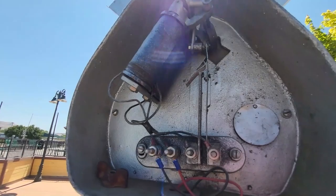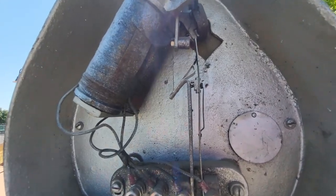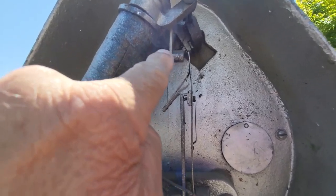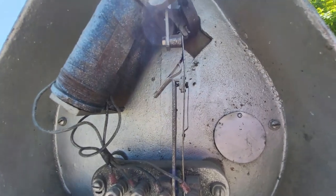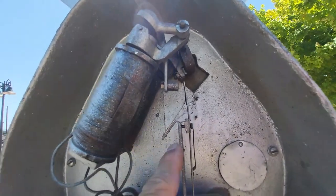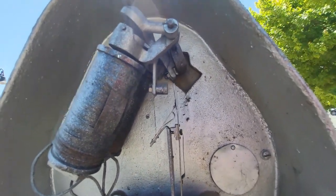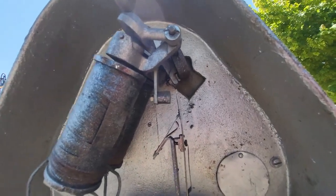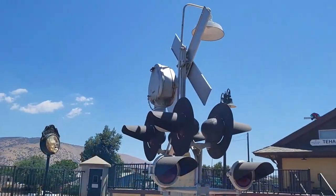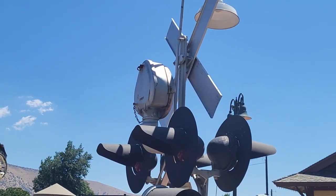Let's go take a look at the gong. You can see how these coils create energy for the armature and pull back the gong inside — you can't see the gong because the bell is bolted on. Anyway, that's how that works: it energizes, then de-energizes, energizes, and then when it hits it opens the contact, de-energizes, and it just keeps banging the clapper inside the gong back and forth.